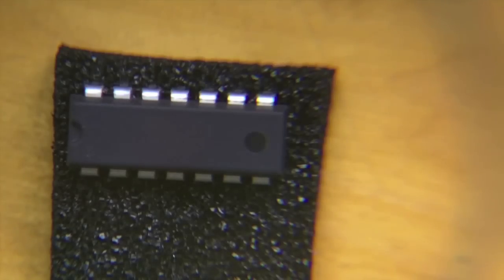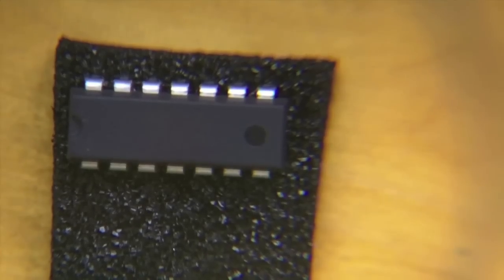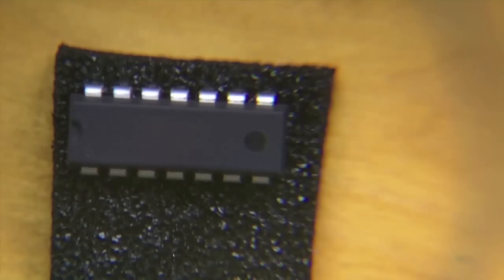Just a quick side note before I start coding. The microcontroller I'm going to use is the ATtiny84. It's a really great little chip — almost a cross between the ATtiny series and the ATmega series. It's a 14-pin device with 8KB of flash, 512 bytes of EEPROM, and I think 128 bytes of RAM. It's got more features and pins than regular ATtinys, which have like 8 or 10 pins.